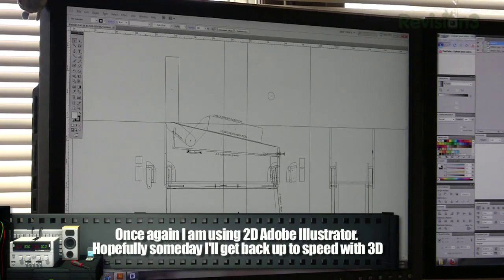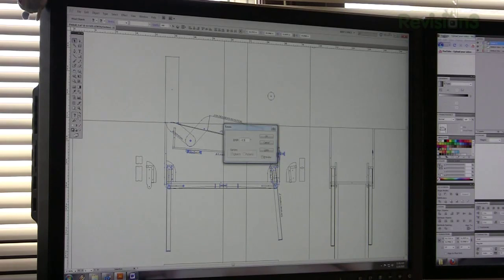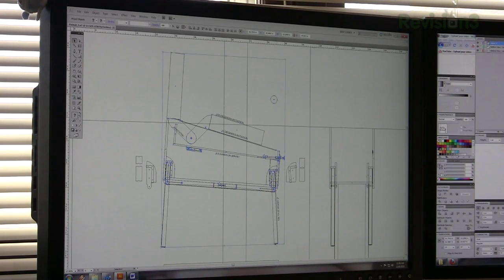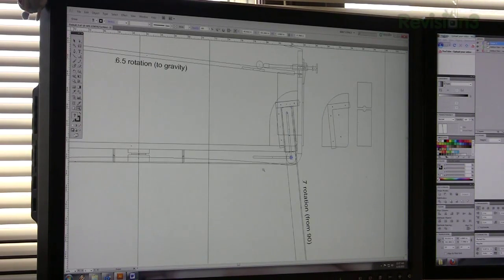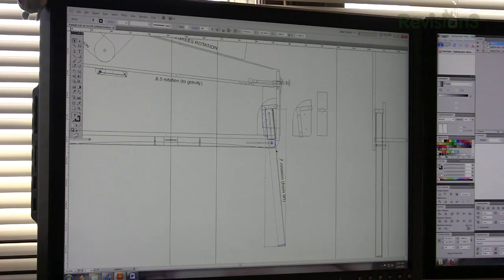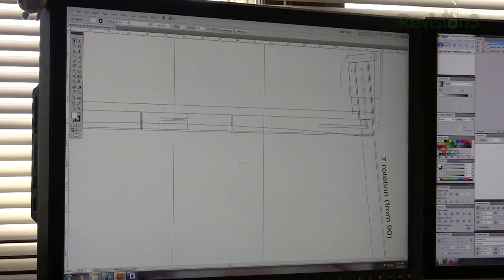Now that the CNC machine is up and working, we can work on the cabinet designs themselves. We have our basic pinball design, however this one is not at the right rotation. The machines are actually tilted forward a little bit at about exactly negative 3.5 degrees, which makes the legs level down at the bottom. The new thing we're going to try is having folding legs. Here's one of the new pinball legs — inside the unit is going to be some square tubing, and the leg will slide out of the tubing. Then it will rotate on a hinge or pin, and finally fold up under the unit.